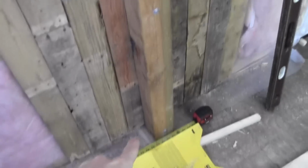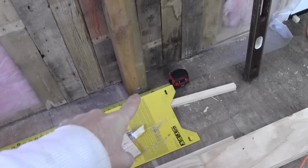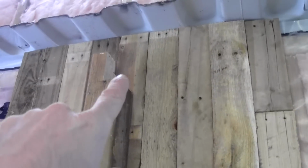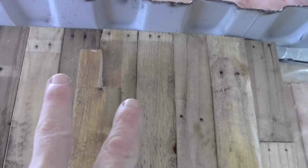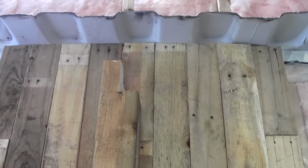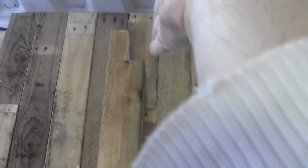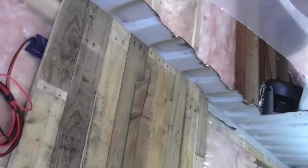As far as the construction, it's sitting just on the base there, with a bolt at the bottom, and then at the top I've got a half lap cut into it, so basically half this width. It goes back 1.5 inches, and it's 3.5 inches tall, which is the thickness of this. So when I build the upper brace, it'll slide into that and lap over that side.